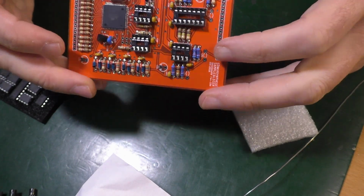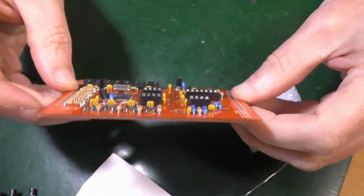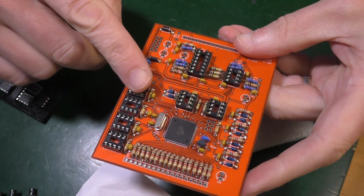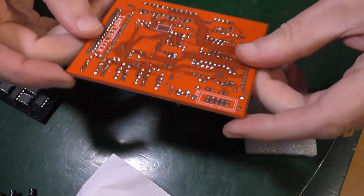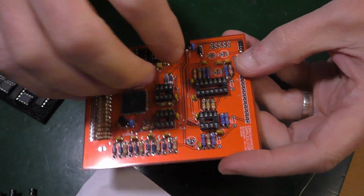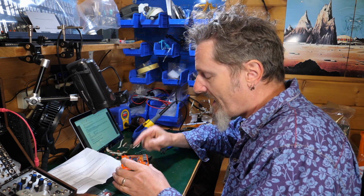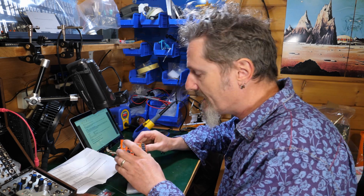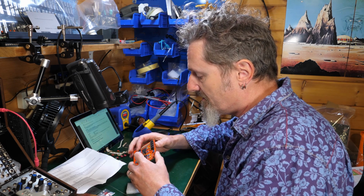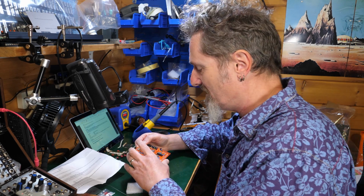The other slight bit of trouble I had there was that the IC holders are lower, shallower, whatever you like, than these components here. So ideally, and the crystal as well, ideally IC sockets should go in first, because then it's easier to lie it flat to solder. As soon as you get things which are higher, it's not going to sit right when you're trying to solder, so it's harder to get these things flat. So I had to use bits of foam and stuff to stick in there to make that happen. Which is alright, I got around it, but when doing an order in how to solder things, if you are a manufacturer of a kit, then do it in height order. So IC sockets come before these big chunky bits that stick up, don't they? That makes more sense. At least in my limited experience and view.